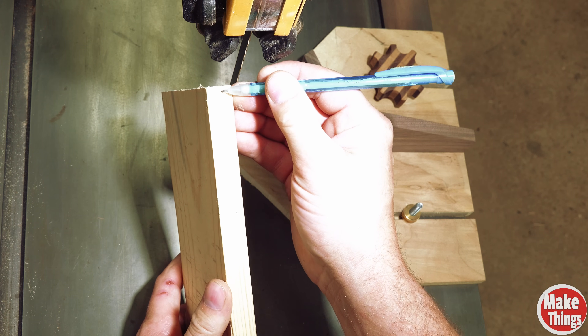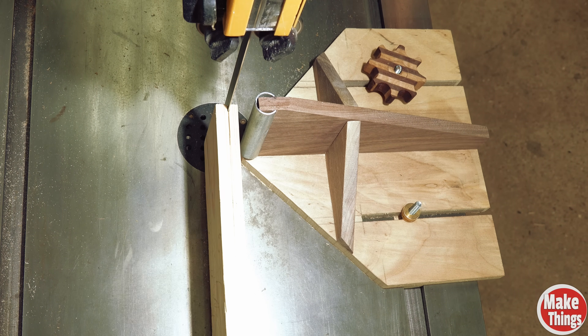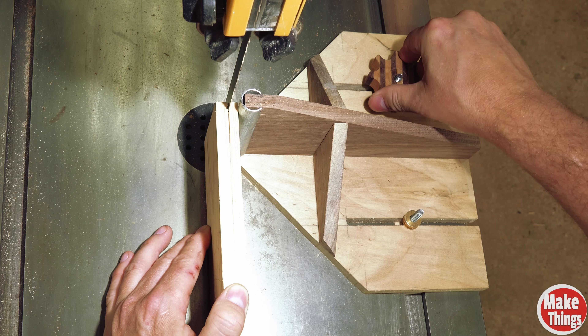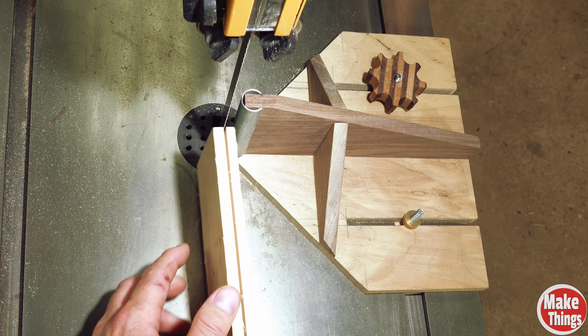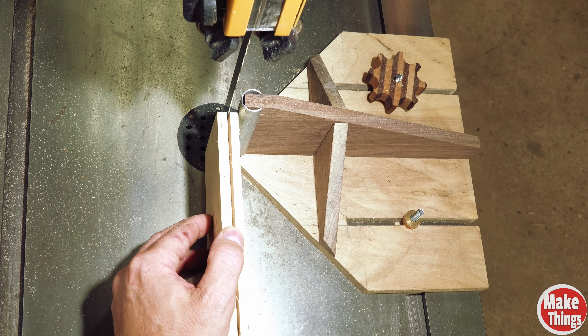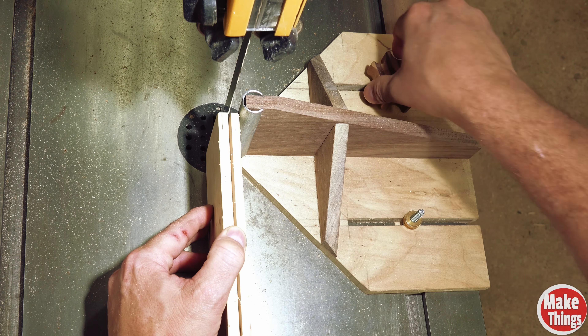There are two different ways you can do this. You can set your line on your stock, cut in a little ways, then with the saw off, push the sled against your stock and cut from there on out. The second method, and the one I really like, is to cut both sides of my stock, then bring it over, line it up to the blade, and find where I am right in the center. If you didn't watch another second of this video, this would be the best option for your bandsaw — but let me tell you why.